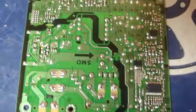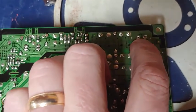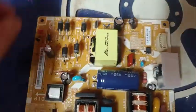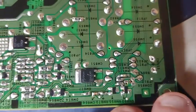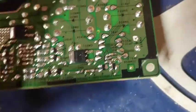I took out the capacitor with a soldering iron — you can get a soldering iron at any home improvement store or online. I touched it on the positive and negative side of the capacitor. The polarity of these things does matter. You can see the polarity: that side is negative, running up and down through there. On the board, you'll see a side that denotes the positive side, so line those up when you put a new capacitor in.